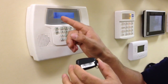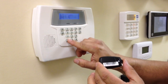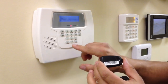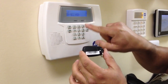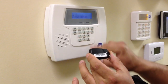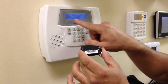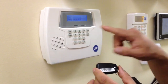Zone 31 — you do the same thing. Hit star, it says disarm zone type — it's already pre-programmed for disarm. Report code is in there, button remote, loop. You press star again, enroll mode, press 1. Then you enter the serial number: 0-7-6-9-2-0-7, star. You'll see it in enroll mode that it's in there. Star again. Zone descriptors — pass that, star. Now you're on 32.